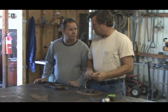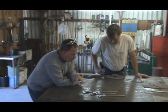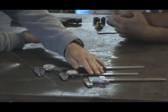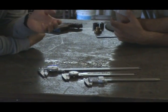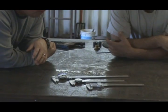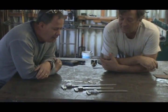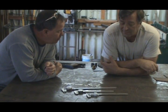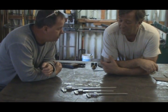What you got? How about a pair of calipers? Let me show you. What we've got here is a couple different sizes of calipers. I brought in a 12-inch set today, an 8-inch set, and then a digital set. For most of us that don't want to spend a great deal of money on these, you can pick them up at Harbor Freight for about $30, probably even less for a regular digital set. Wonderful tool to have. You can measure an inside diameter, an outside diameter, a depth of something. You can even lay out with calipers. Very handy tool to have in the shop.